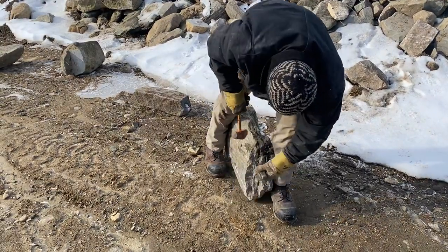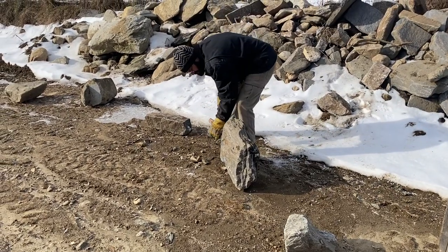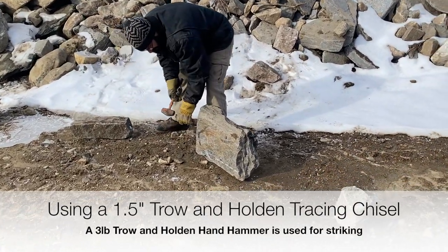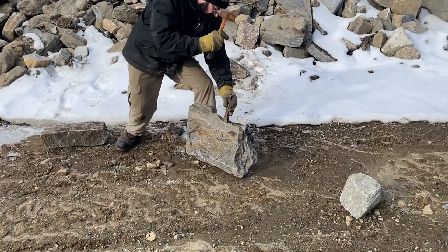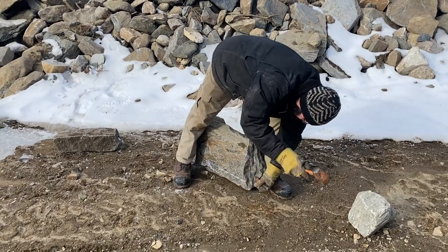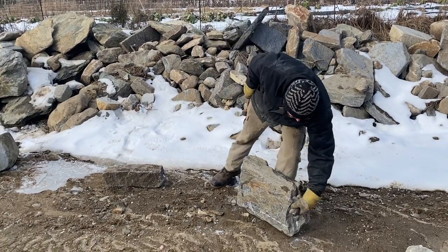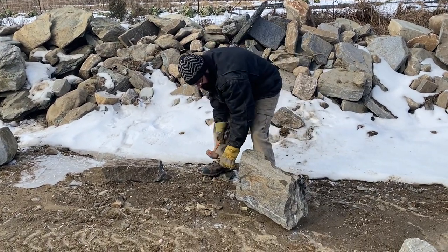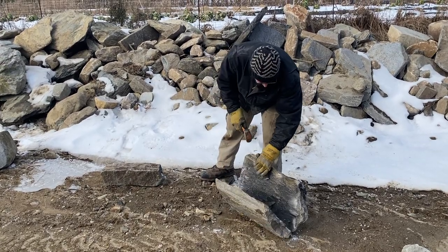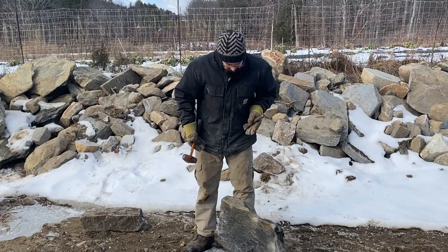With this type of stone, you can see after a couple taps I've already got a crack going. In this case I'm going to strike around three sides so that you're balancing out the pressure on the stone — otherwise it could tend to crack off through the layer, particularly when you're into thinner layers or weaker stones. There we go. That shows the real power of a tracing chisel: that finer angle allows you to get all the way through a stone without it breaking apart halfway through.